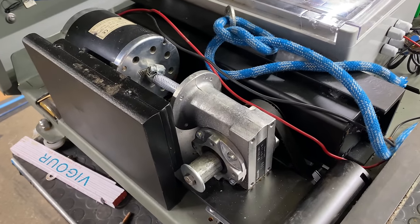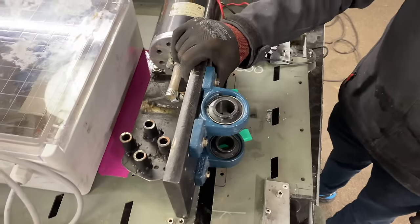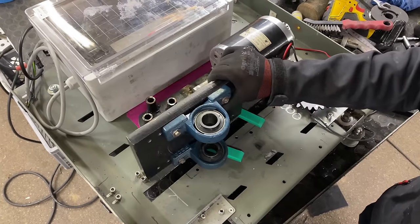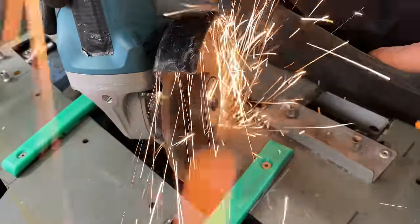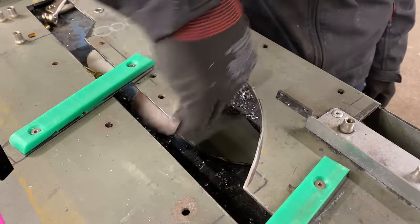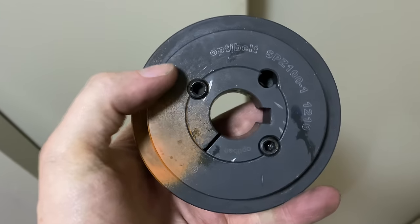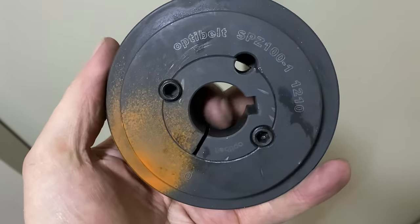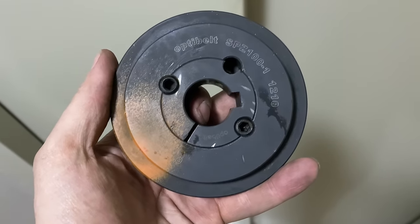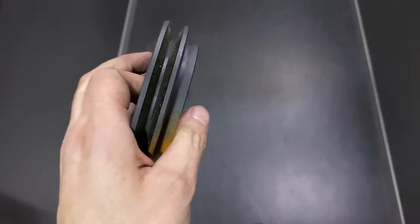So we need a rack and pinion gear. The motor has to be flipped over 90 degrees to drive directly on the rack. This is the third iteration: the motor swings on an arc to push the gear into the rack that will be welded to the track. I cut a cutout so it has a path to travel into the track. I will 3D print the gear and bolt it to this pulley — two set screws pull the inner part in and out, clamping around the shaft for a really good connection.